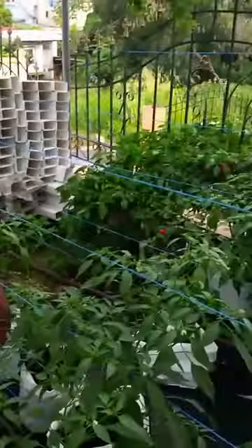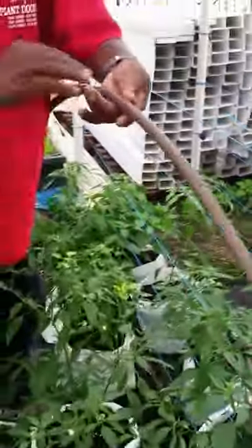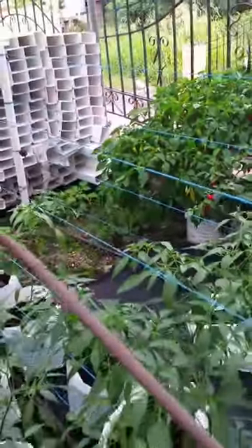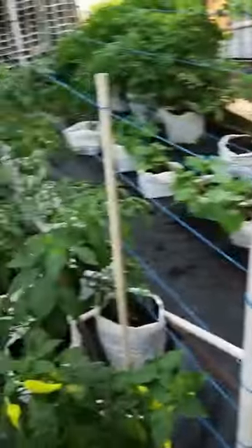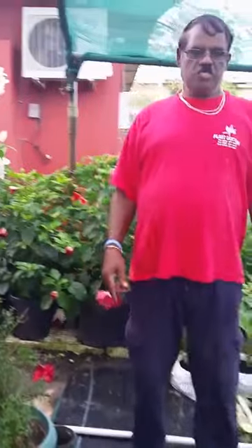This line you see here is what you call an irrigation line. This is the irrigation tubing and they carry what you call emitters. This is a PCE — a pressure compensating emitter — that carries three gallons per hour. This is connected to our stock tank, or reservoir. The reservoir has the solution, and these go next to the plants to feed them. We feed our plants once or twice a week. If you want to water our plants we set up our timer here — this is the timer — and we set the time to come out once or twice a day when the sun is hot to have our plants irrigated. So this is the system that we have. It's very cheap and very simple.